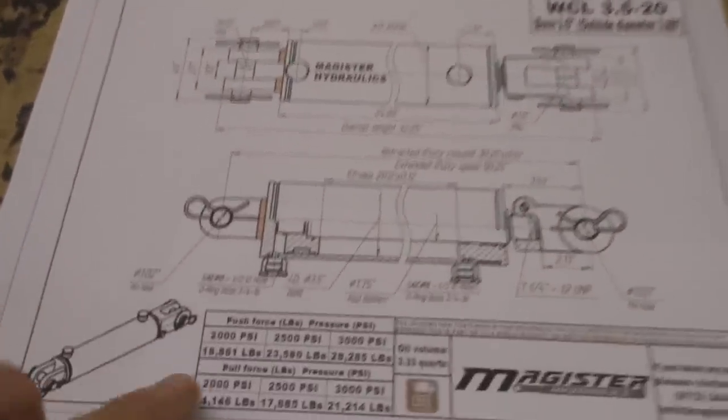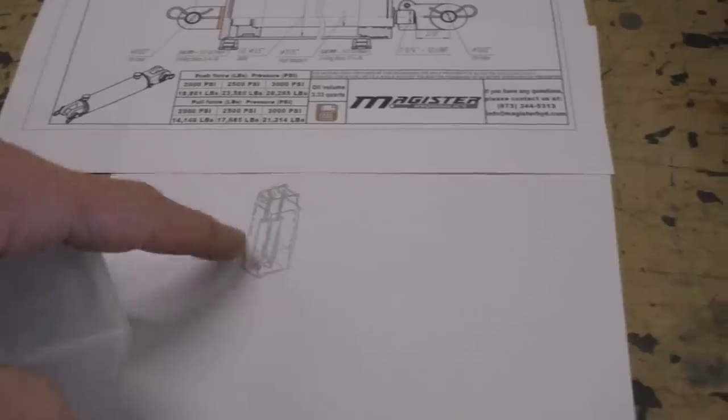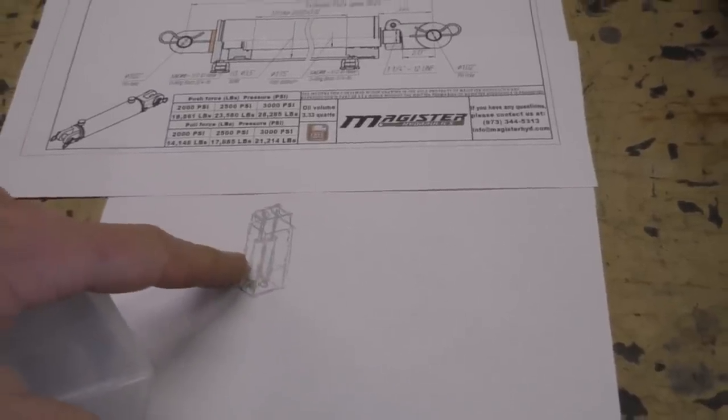So I have hydraulic cylinders. They're for the rudder, but they're big enough. Then we've got this little portable pump that we've been testing our crane with, and that does easily 2,000 PSI. And these are the rams that work the rudder, so they're not doing anything. And they lift at 2,000 PSI, 9 tons each. So if we just put two of them together, we got plenty of force going up.